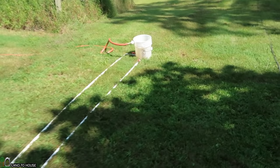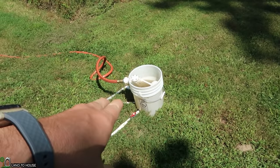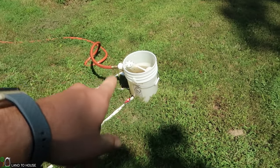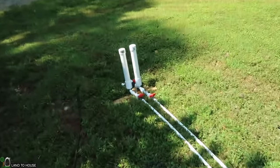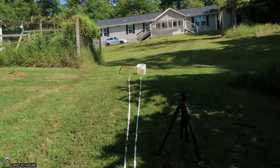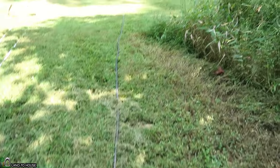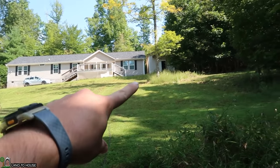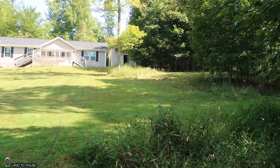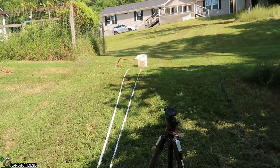Normally, you would run your ram pump in a creek or small river. In this case, I've got a five-gallon bucket with a garden hose and a float valve, and that will supply the water for this test. That right there is about one foot of head pressure. I've got two half-inch PVC pipes coming down as the drive pipes, and it's going to drop about three feet, so the total drop is around four feet, including that one foot of hydrostatic pressure in the bucket. I'm going to turn on one pump and let it cycle through this garden hose, which I've got 200 feet of. It circles way up around here, goes around the house, and up the hill over here. Hopefully that's enough lift that we'll find a point where the water stops going any higher, then we'll turn the other one on and see if it increases the height.